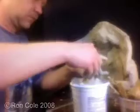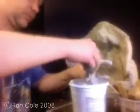You'll notice that as you dip the patches of burlap in, a lot of the material falls off into the plaster, but that becomes useful. You pull out the loose strands later to stuff into places that are hard to get into, like armpits and between the legs and corners of the mold.